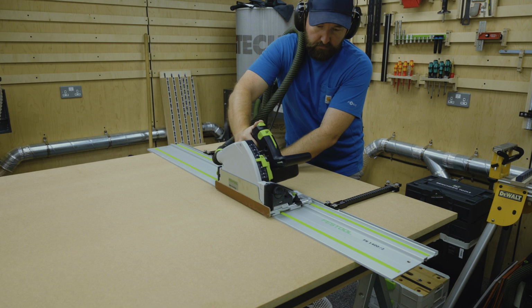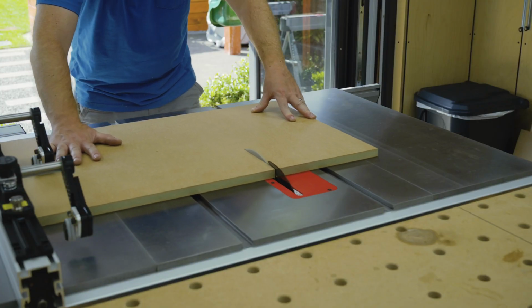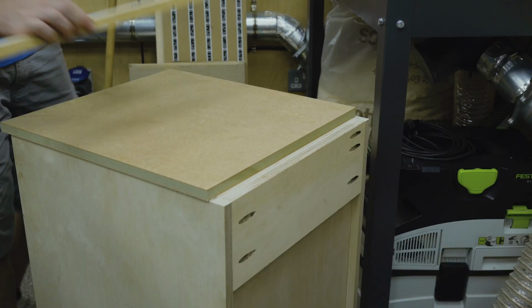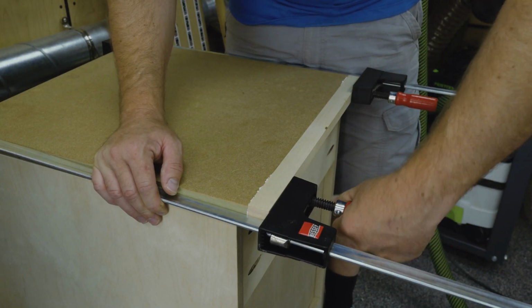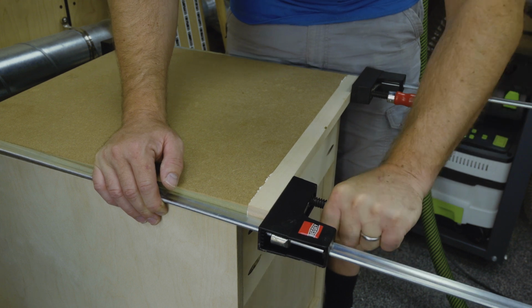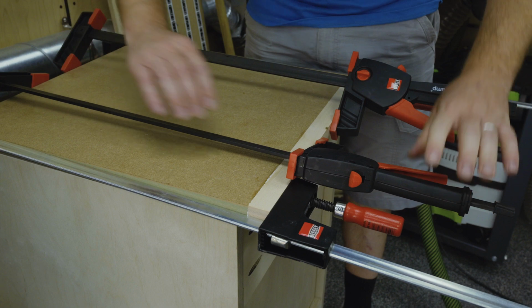For the replaceable top, I used moisture resistant MDF and took to target size, having first rechecked actual dimensions. We can now cut our rear bumper piece and then join them together. Here again I just used glue, making sure that there was no glue residue on the underside to allow for later top removal if need be.